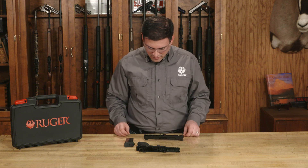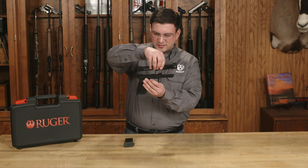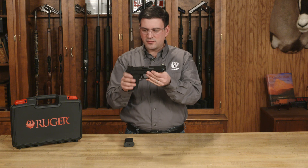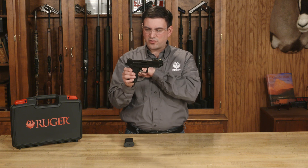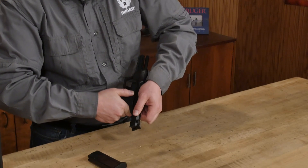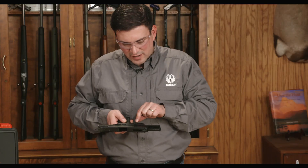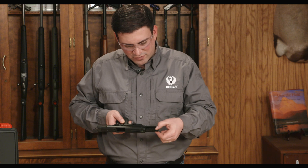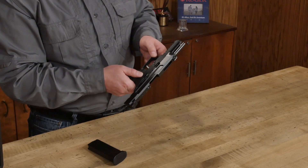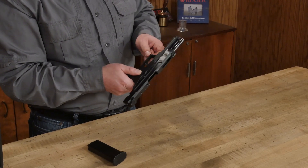With everything centered, I can now pick up my grip frame assembly and put the slide assembly right on top, about a quarter inch forward of the rearward position — it'll just settle right on top. I'm going to lock it back to the rear, pressing up on the slide lock with my thumb to hold the slide in the rearward position. Before I can rotate the takedown lever, I need to push back on the barrel. We're going to push the barrel all the way back, rotate the takedown lever 90 degrees, and then press in so it snaps. I get a nice click on that takedown lever — that way I know it's locked.